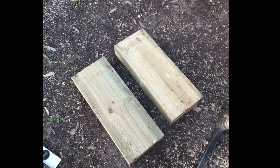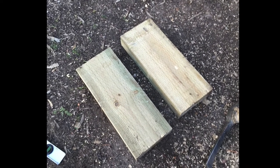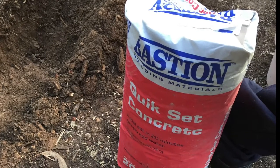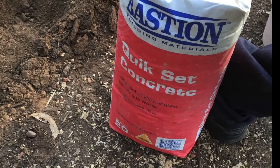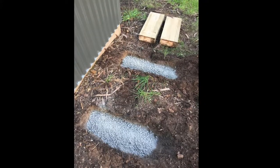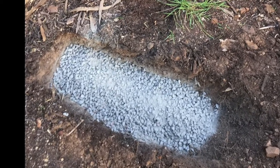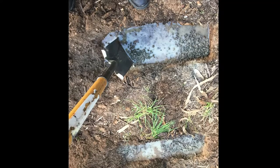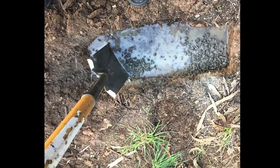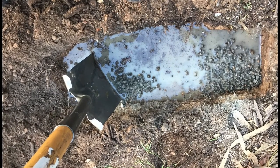The legs don't actually look the same length in this shot but they are — one's just sitting a little bit closer. I had four legs cut to length ready to go, and I needed to get some concrete into the bottom of the holes to make a firm base. I bought quick-set concrete from the hardware store — it's got aggregate, stones, sand, everything in there. You just tip it in the holes, add water, mix it around with your shovel, and it sets hard as concrete.